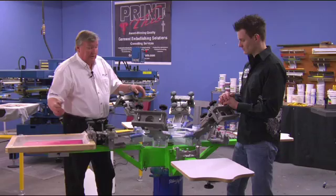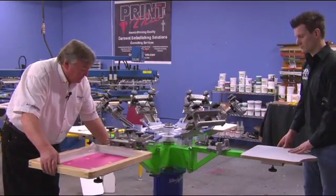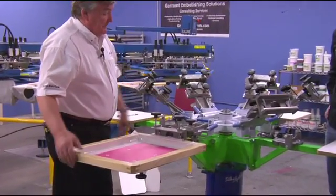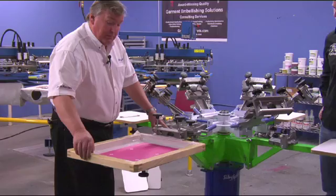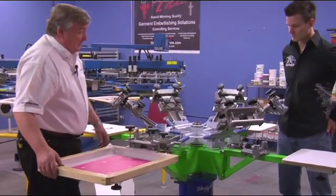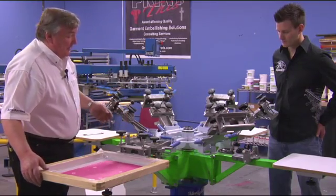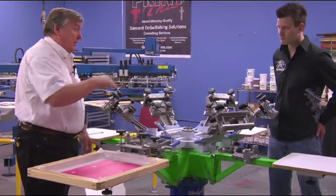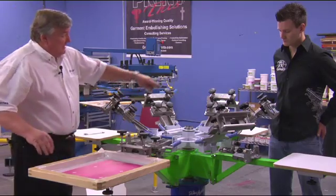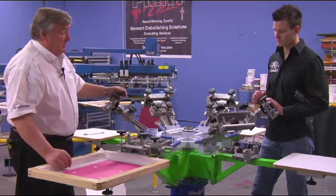Occasionally on a press that's maybe 10 to 20 years old, you may find that there's just a little bit of side-to-side play at the outer end of the screen. The big rebuild secret is that these nylon bolts become a fulcrum for this lever. So you go back and pretend that you're going to be replacing the springs, take this top bolt out, release the springs, and then tighten this axle bolt up until the arm stays at an angle. Back out just a little bit, crack the wrenches loose, just to the point where the arm drops. And you can set all of these printheads the same way. It'll get rid of all the side play, and you've basically rebuilt your press in about five minutes.